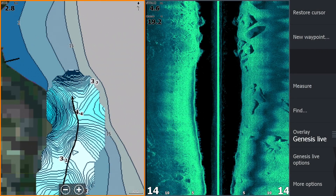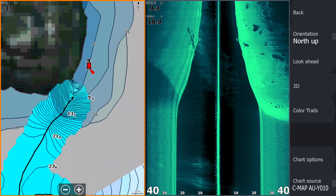So the 800kHz one you're going to use in that sort of shallow water, creeping up to the edges of the banks and whatnot, where range doesn't really need to be sacrificed. If you want to go greater distances, you can change over to 455kHz and you have that little bit better range.